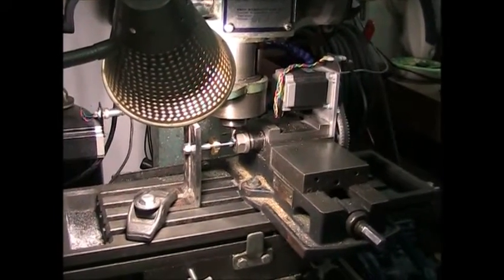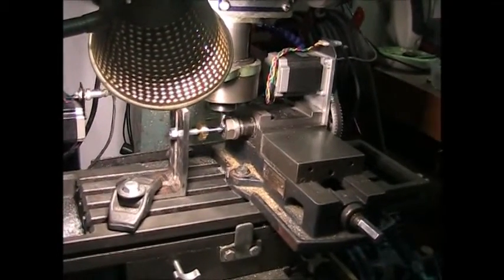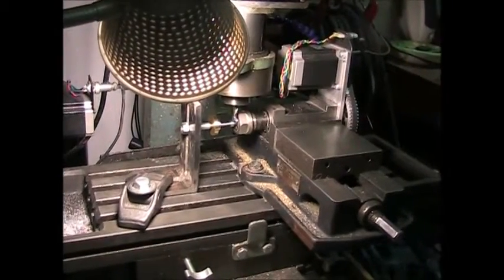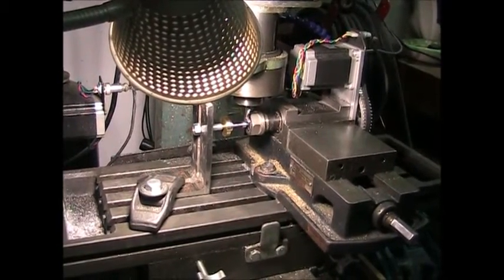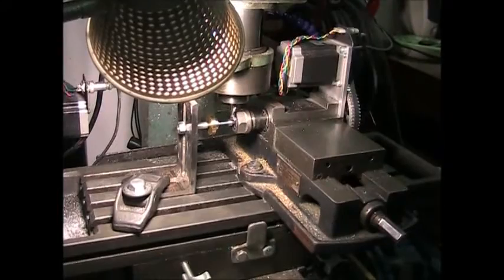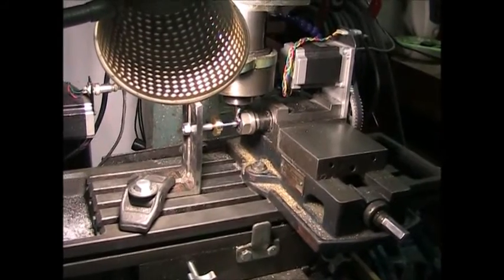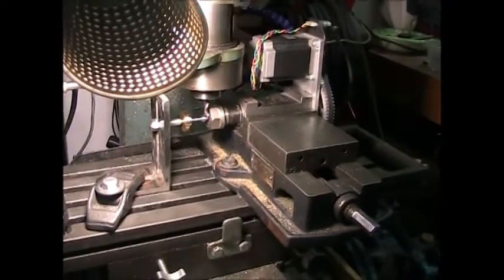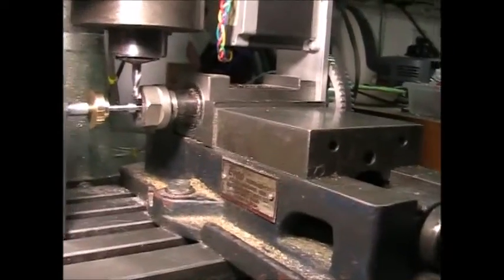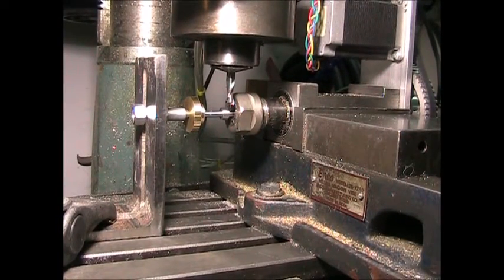Here's the setup for milling the camshaft for my horizontal twin. I've got to do four cam lobes, and I've got it mounted in my fourth axis here in my milling machine. The bulk of the cam is back inside the fixture. I will cut one lobe, then loosen the cam from the fourth axis and pull it out until the next lobe is just clear of the ER collet chuck, then cut that one, and so forth. I've got a brass disc with an index mark which shows me the zero point so I can always get it back to zero.